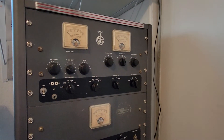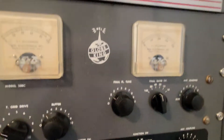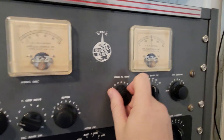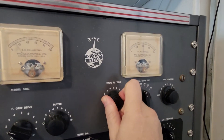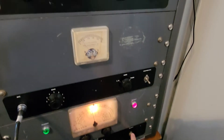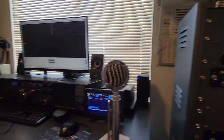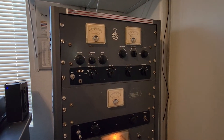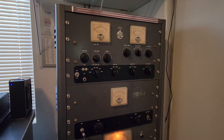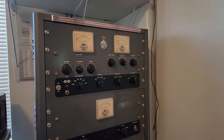So this is all preset. We're going to go ahead and throw the transmit switch here, or I could key my D-104. Let's go ahead and do that — we're going to monitor plate current. We got the plate tune here. That's really touchy on these, but we are dipped. Go ahead and return the plate switch down. Now there's a bird watt meter over there — really hard to see on the camera — but the bird watt meter is indicating about 100 watts of carrier. That's good in tune; 50 to 100 watts. We're just going to get the pi network here in resonance.